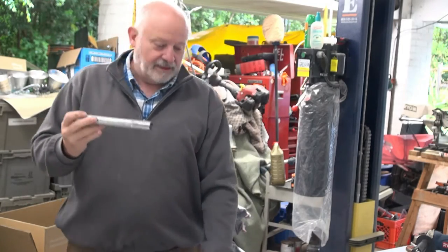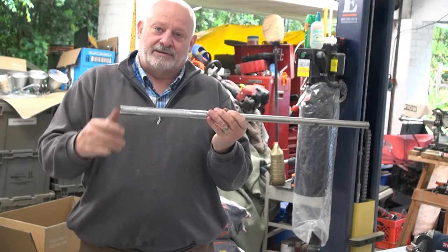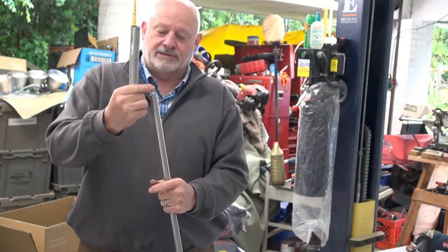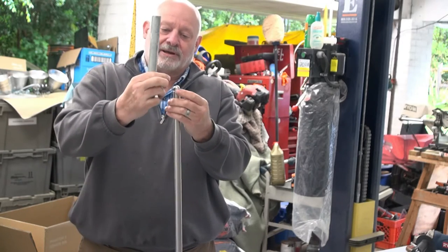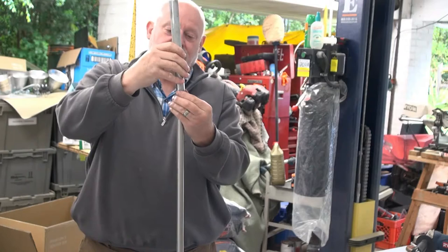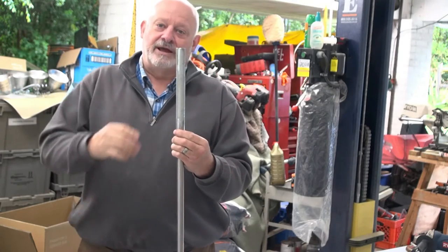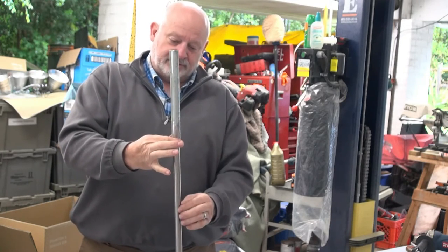I've got this stainless steel shaft that's going to go up and ride along inside. I have these two ball bearings that I'm going to use — they're different sized. I've got a small ball bearing that's going to be right on the top of this shaft, and then a larger ball bearing that's going to be on top of that. The bigger ball bearing will contact the base of the surface welded across the top, so it'll be very light friction — the weight of two ball bearings with a little oil. This is stainless steel so I don't have to worry about rusting.